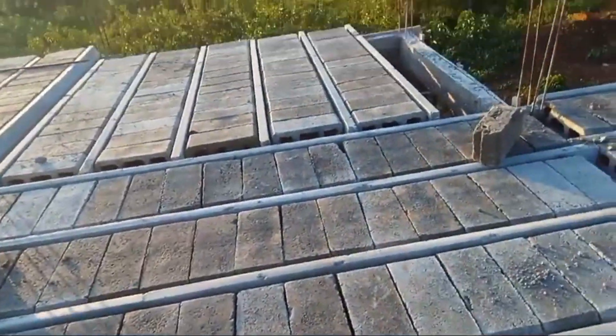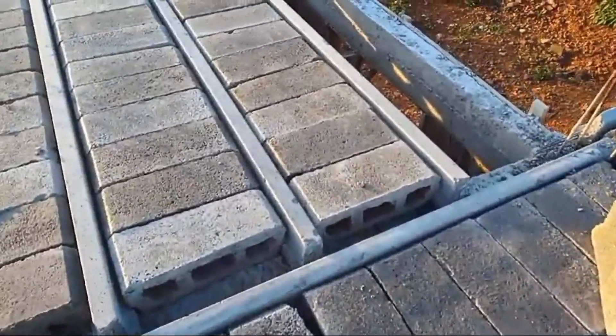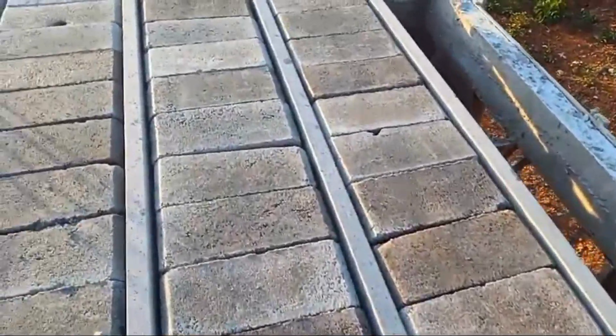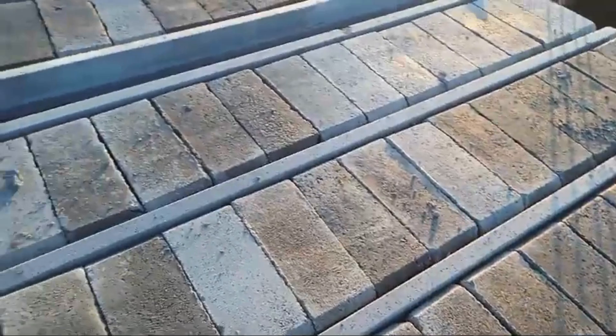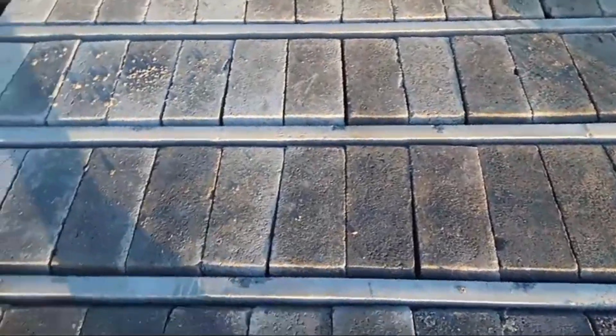For people who like things neat, hiding pipes and wires — those hollow blocks are perfect for that. You can run underfloor heating pipes, water, electrics right through the cores inside the blocks, keeping everything tucked away for a clean finish. One last benefit mentioned: earthquake resistance. In some contexts the system's inherent strength, especially when used with other reinforcing elements like plinth beams, can offer better performance in seismic zones compared to some lighter or less integrated construction types.